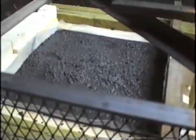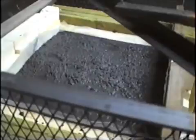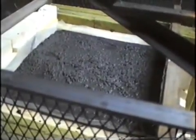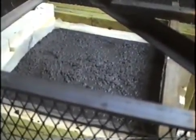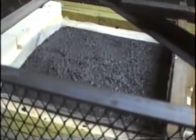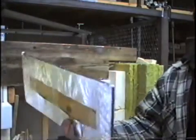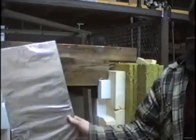I've poured the castable in place up to the level which meets the two sides. So now I'll go to the drawing and show the placement of the two remaining mold parts that will shape the top of the crown. Here are the plywood boards I'm going to use — I wrapped them in tin foil.